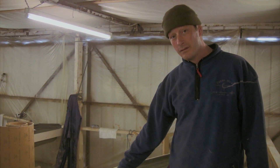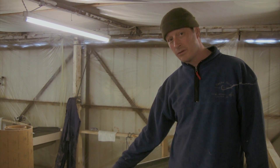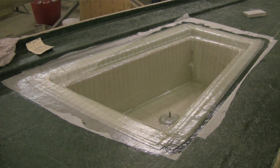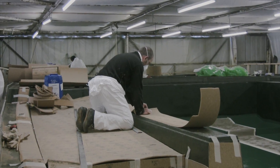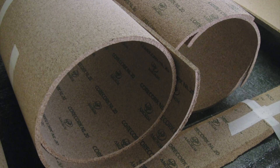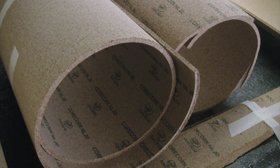The problem is with blow holes — they're holes and of course we're infusing the boat so we have to make sure we can seal them, because all these blow holes are actually having a fitting put in so that we can then link them all together. We might cut the core basically on all the flat surfaces — we'll put in a core and just separate the surfaces of the laminate to give us a stiff amount.